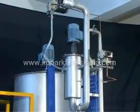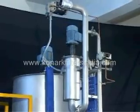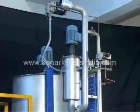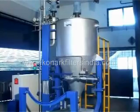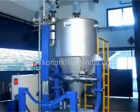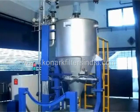In this chamber the slurry is dosed with a chemical to assist in clarification through this inlet set and this settler drive. The operation of this equipment allows the slurry to stand and clarify in the settling tank for eight hours. During this period the sludge separates from the water or filtrate, leaving the sludge at the bottom of the cone-shaped settling tank and the filtrate at the top.